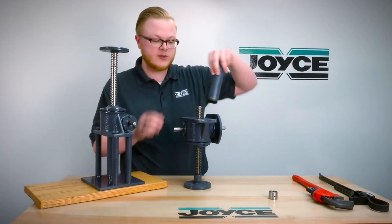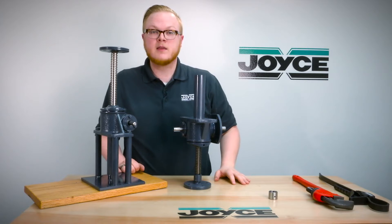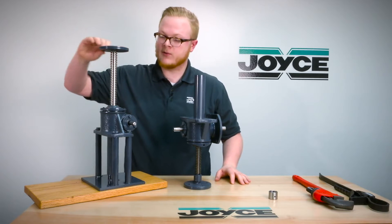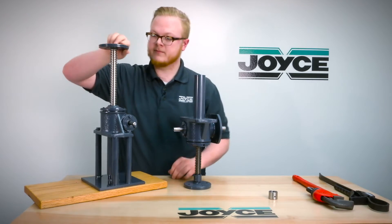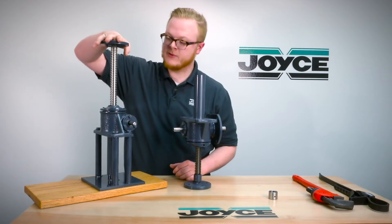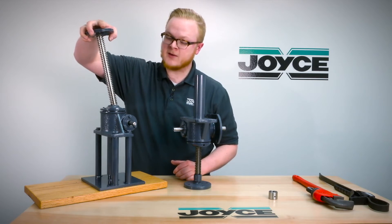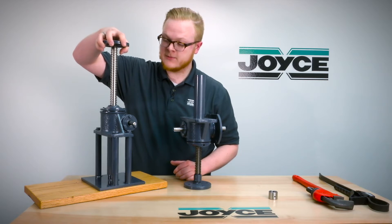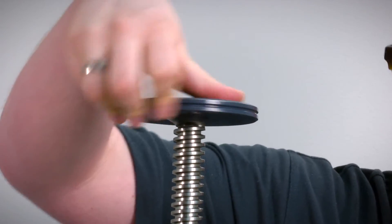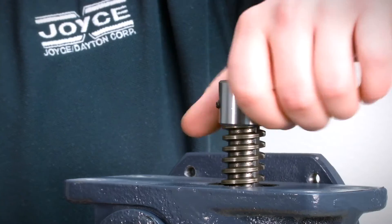After removing the stop, you can then remove the screw on either jack. For demonstration purposes, I'm going to return the protection tube back onto the keyed jack. To remove the screw from the translating style jack, you will unthread the screw from the jack housing. Once it's free, you can remove it and replace it with your new screw. Carefully lower the new screw into the sleeve until it meets resistance, then while applying a slight downward force, re-thread the screw. If there's an extending screw stop, replace that, and then you're complete.